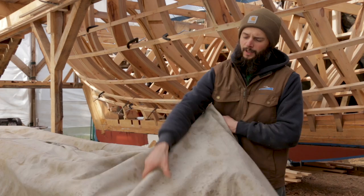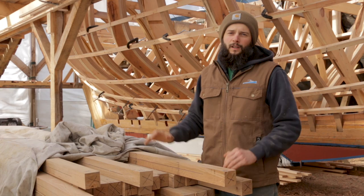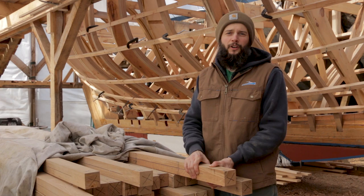The first place to start with framing would be the framing stock. This is the framing stock that we milled up but haven't gotten to quite yet. This is all white oak and it came from the trees that we harvested on the property. We went out to our oak pile and started digging through it. Since the bent frames aren't very big in dimension, we need to make sure that they're clear of any defects and that the grain runs straight in the board, with very little grain run out in the frames.